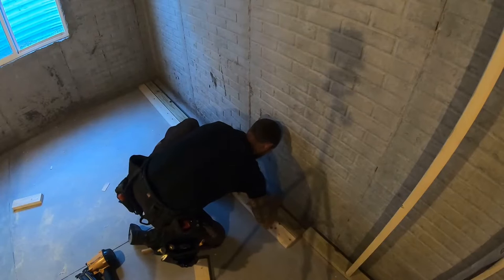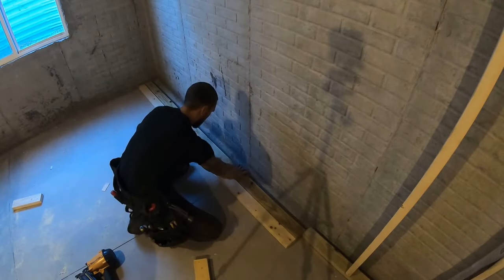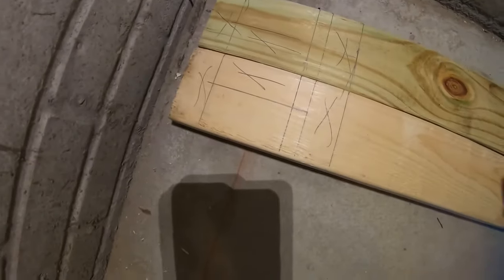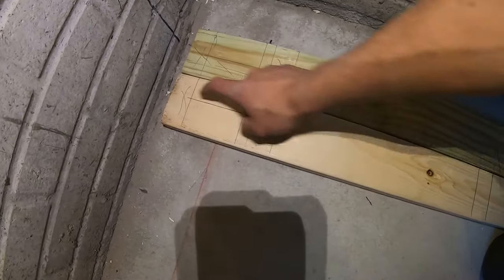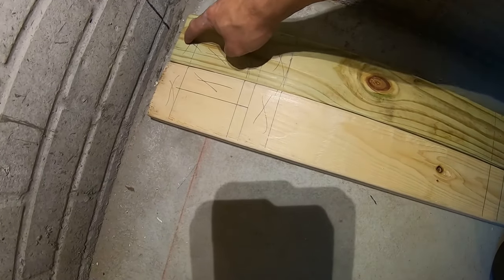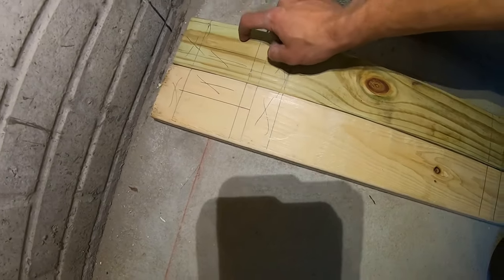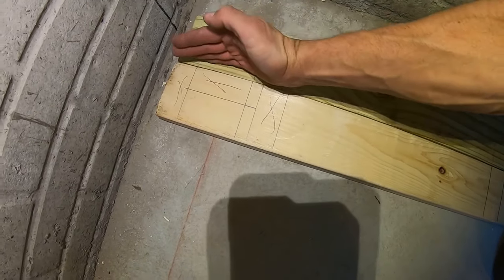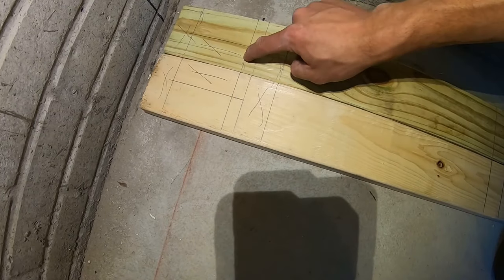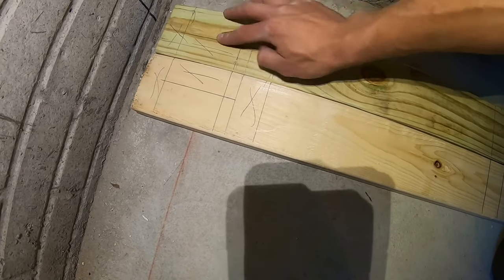What you do is use my square. So I'll show you how to lay out a 3-stud corner. You can see here's my last stud. That's on layout. It's 1.5 inches. Then it'll be easier to picture the bottom stud because this will face this adjoining wall. But from your stud, come over 3.5, obviously 1.5 inches depth.